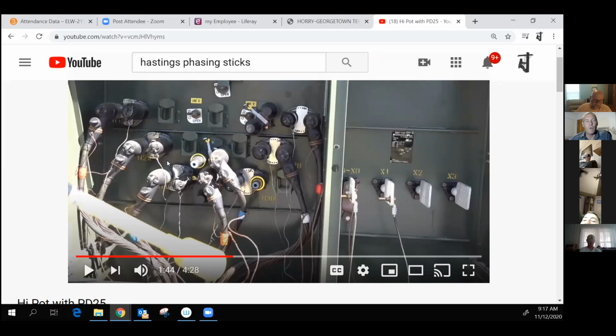What we like to do is when we install this stuff, we go behind these elbows where it's not really draped down across it. Or if we have to move this elbow out, we want somebody else with a shotgun stick to pull this out of the way, depending on where it's going to go. We want to make sure these are clear of the elbows because, like you said, the little white tips could get into the primary and cause a big flash, or get into those grounds and cause a big flash, so you want to keep them out of the way.